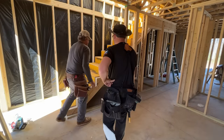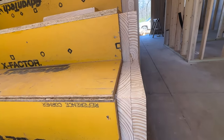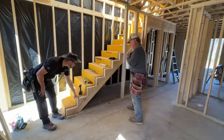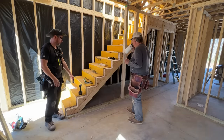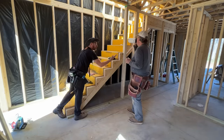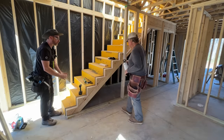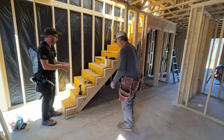Arlo is making a racket down here so I came to see what he's doing — he's packing out the side of our stairs with three solid stringers. He's going to cut one more so that when our posts come down here, here, and here, they have solid wood under them to screw down and attach everything really nicely.